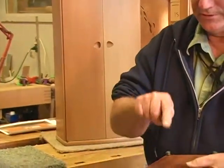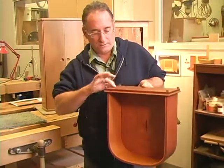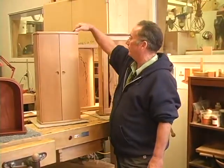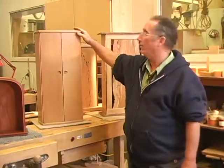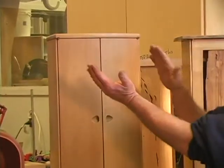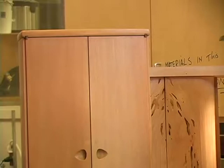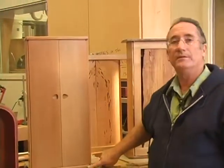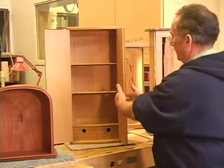What I did is I drilled this on the drill press and then created a jig to hold it while I drilled into the laminate to attach the dowels. These carcasses are all doweled — the dowels are in the end of these pieces and run into the top and bottom. When you're doing a doweling joint, you can't have a flush joint. That's how you can tell a cabinet's doweled: the top and bottom extend past the side slightly. The reason is there needs to be some wood outside of the dowel to add strength. If the pieces were flush, the dowel would be too close to the end grain and would possibly pop out.